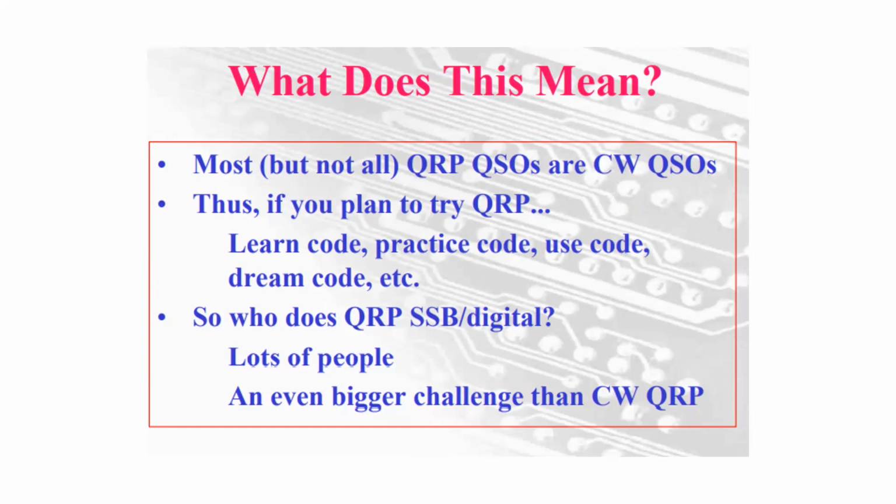When I got restarted in amateur radio, I started out in QRP, and a number of times I just couldn't find any stations to work. Maybe I worked a few on CW. And really in my mind, I didn't think you could really do SSB at QRP levels. But anyway, I found if I jumped over to the upper part of the band and tried single sideband, I could pick up quite a few contacts. So results will vary, but basically if you think you can, you can.